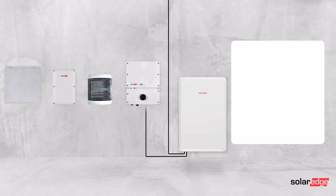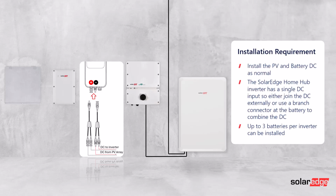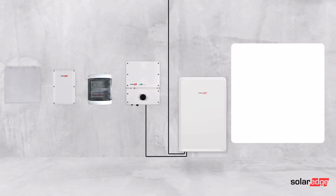So wiring it, DC comes from the roof to the battery, use the branch connector, and then go to the single input in the DCD. If you're going to install more than one battery, again, just use the branch connectors because it makes life an awful lot easier. The PBS is 63 amp rated.